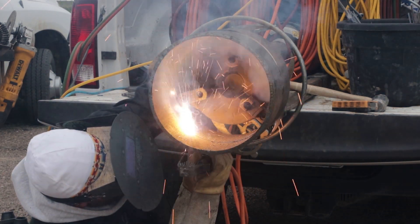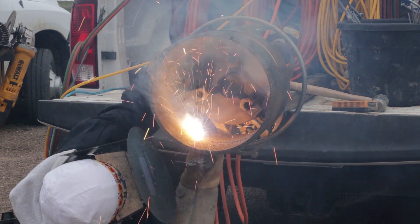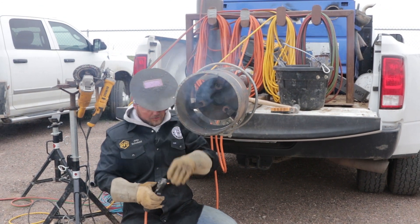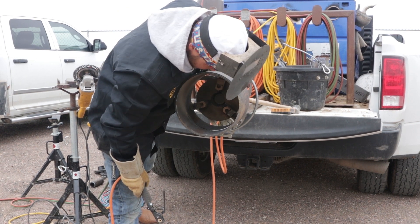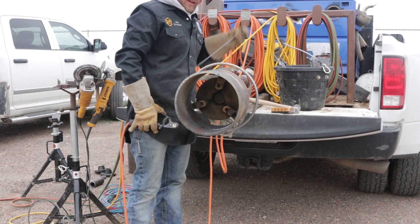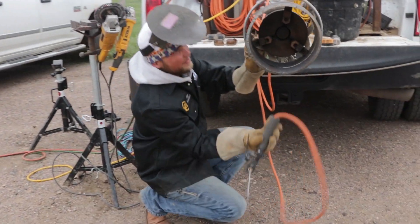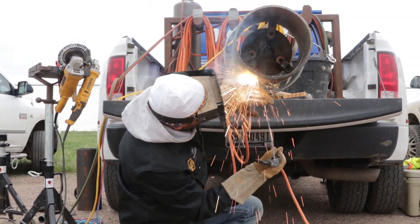She's going to get wide again right down here. On the wide side, one thing you've got to really watch out for is a concave root. The way to avoid that is to turn it down a little bit. There's a little bit of concave in there — we'll probably have to grind through and fix that.